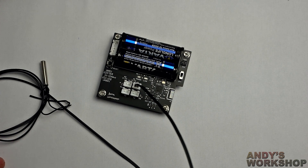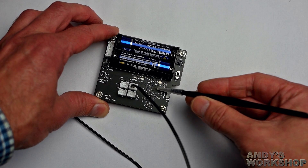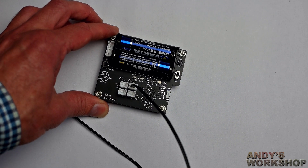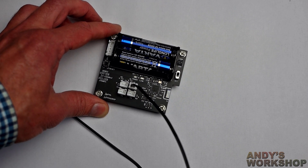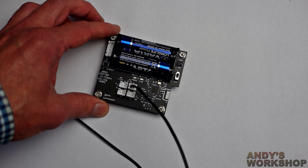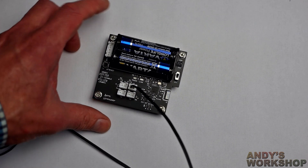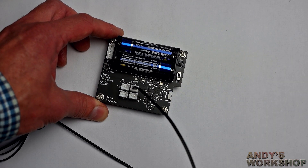So let's talk a little bit about that. This is the board I built around the STM32 WB55. It only comes in a QFN package or a BGA. You can't get it in the nice hobby-friendly lead packages like the LQFPs. I suspect that's because it's got wireless built in — you wouldn't want those pins to become unwanted antennas. So to keep the signal integrity in check, they only make it available in packages that don't have any leads. Now that makes it a bit of a pain to work with as a hobbyist, but this did actually work out well for me — I didn't have any mishaps building this thing.